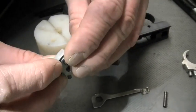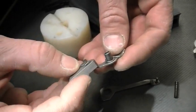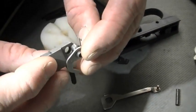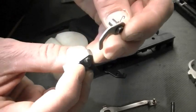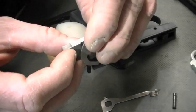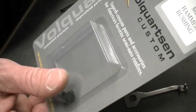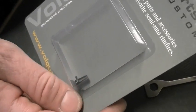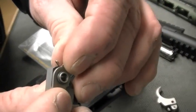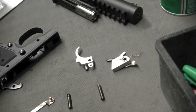This is your magazine disconnect — we're going to get rid of all of this. We're going to use a Volquartsen hammer, so these stock parts are not used. Some guys have different ways of making up for this notch — they have washers and different stuff. I like doing things the right way whenever I can. I just bought from Brownells a Mark II hammer bushing that's going to go in and solve the lack of width since we take this part out. So we're going to have Mark II internals — magazine safety gone.